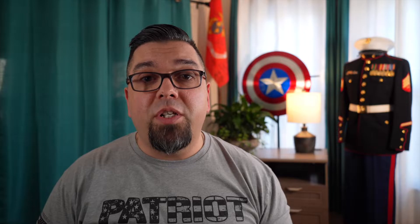Hi, I'm Chris Moore with HVAC Pro Blog, and I want to welcome you back this week where I'm talking about using the age-old firing rate calculation. Most inspectors and energy raters avoid attaching a manometer to any gas valve, particularly since in most states you need a license to do this. But by simply clocking the gas meter, one can determine the amount of BTUs input for appliances like a furnace, boiler, or even a water heater.